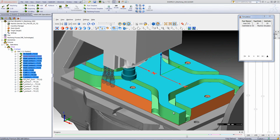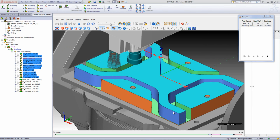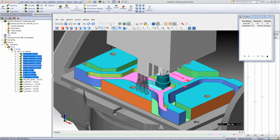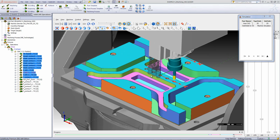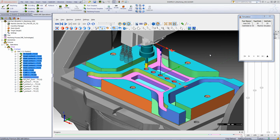Now when it finishes this level as shown over here, it'll then go and do the finish cut using the iMachining. Now working with iMachining in these areas over there and inside these pockets over here, then working the holes and milling out each hole to the very bottom as for in the operation itself.